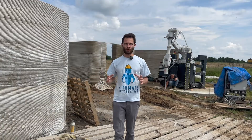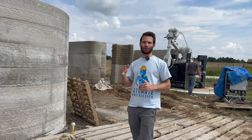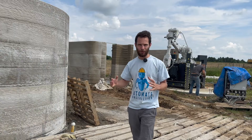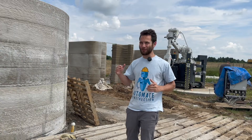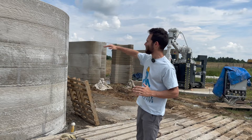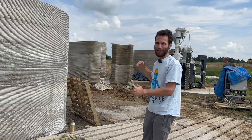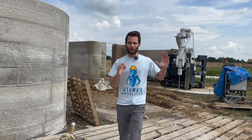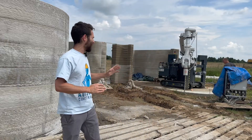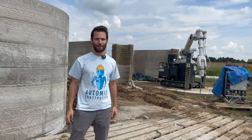One of the biggest challenges in reducing cost on the construction site is labor, and even though 3D printed construction hopes to reduce on-site labor, a lot of times it's still very hard work. When they were manually mixing, they had to stop and remix material constantly even though the printer could have continued if material had been ready. Now that they have the truck, they'll unlock additional capacity and achieve even more cost-effectiveness, advancing automation on the job site.